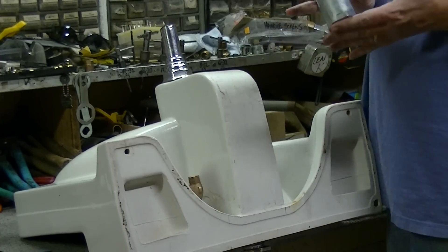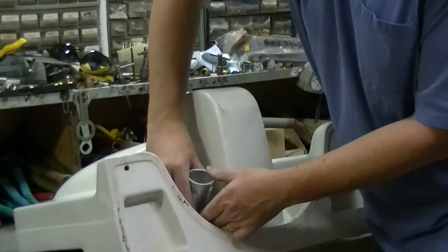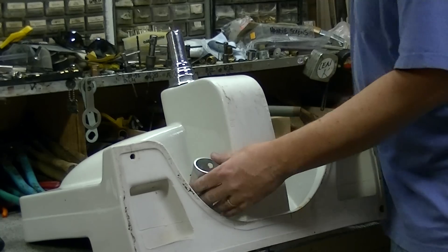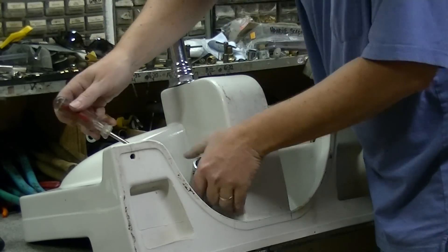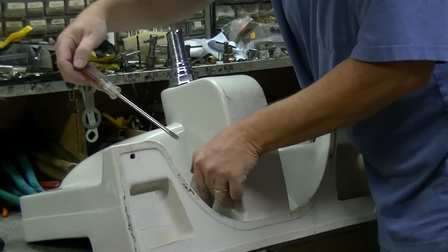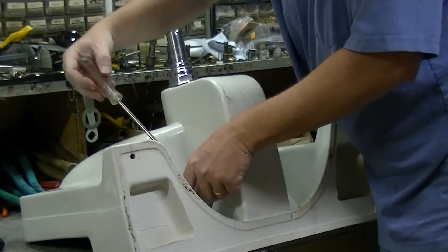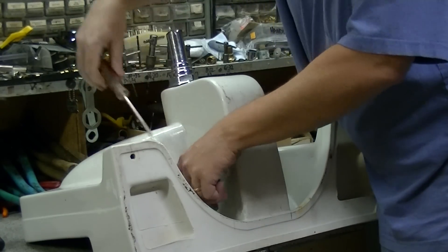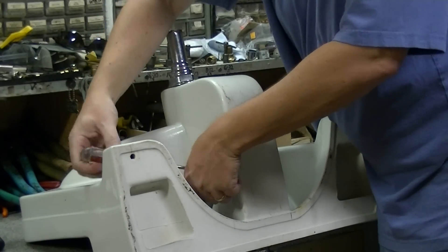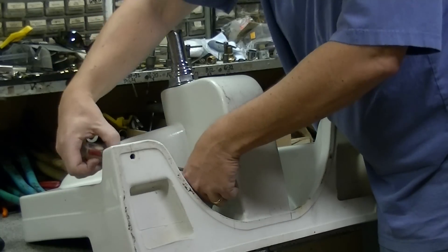Using our Special Tool 31-9943 socket wrench, you can tighten up the nut. You don't want to over-tighten it, because you do run the risk of popping the porcelain off. But this does do an excellent job.